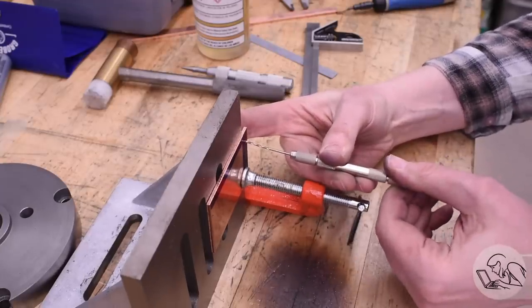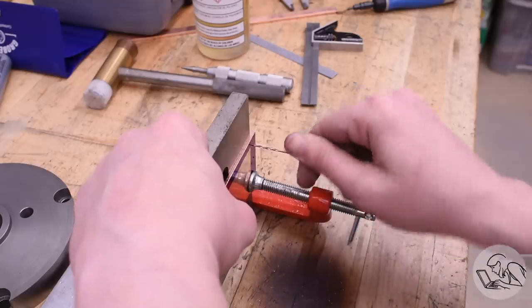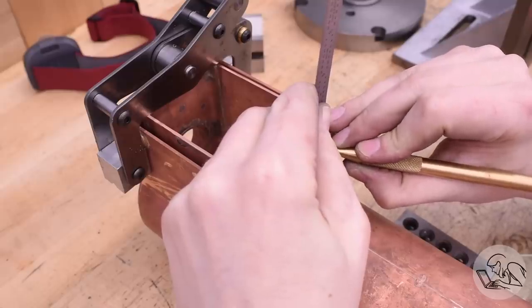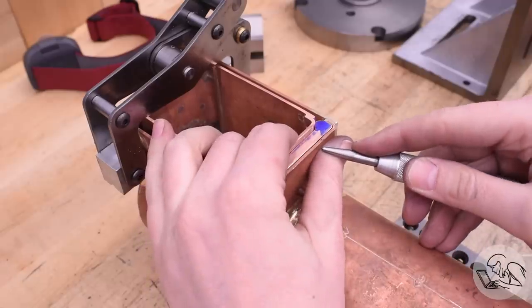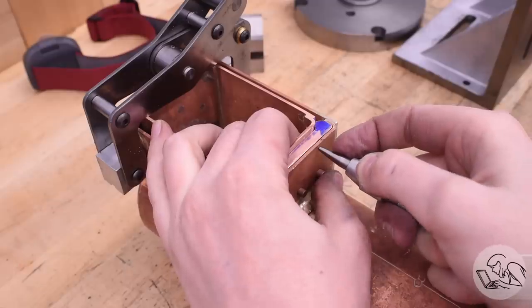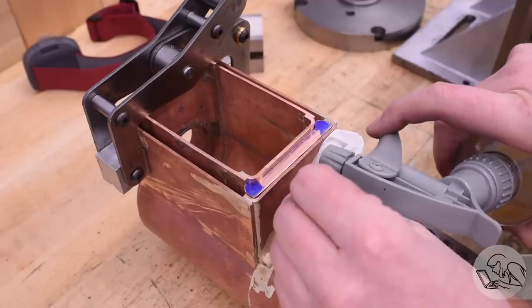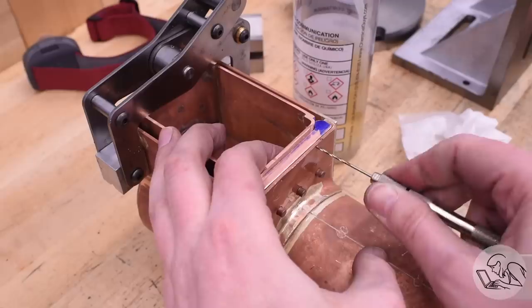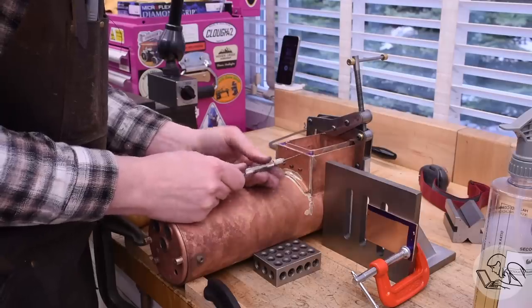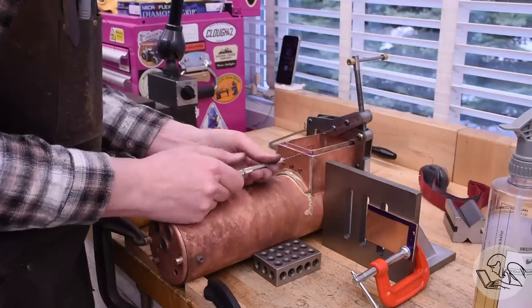Drilling by pin vise is not a lot of fun and it takes a while, but it does work. I considered my hand drill as well, but I was afraid it wouldn't run fast enough — if you run small bits like this too slowly in a powered tool, that's how you break them. And I was very concerned about breaking a drill in this boiler at this point. So I'm going to do it by hand. I start by center punching where these holes need to go. Because I'm doing this by hand I had to eyeball the measurements, which was a little risky as I have a very small space and have to center these holes on those thin foundation ring bars. This takes a few minutes per hole and your hands will be sore, but it's low risk and guaranteed success — and that's what I like at this stage of the boiler.